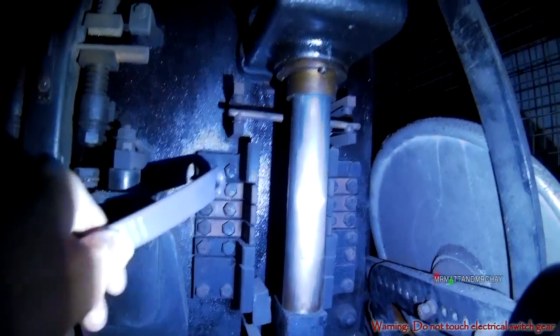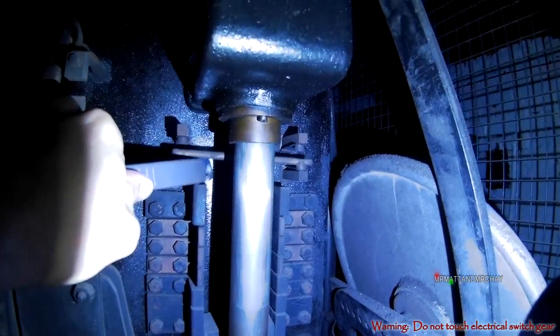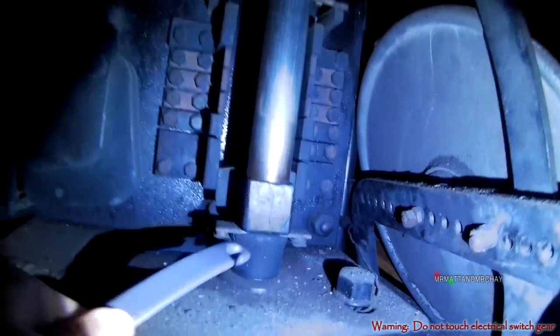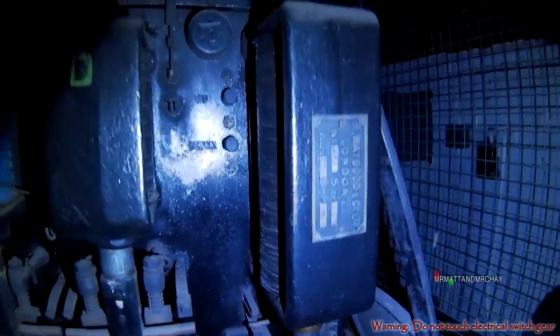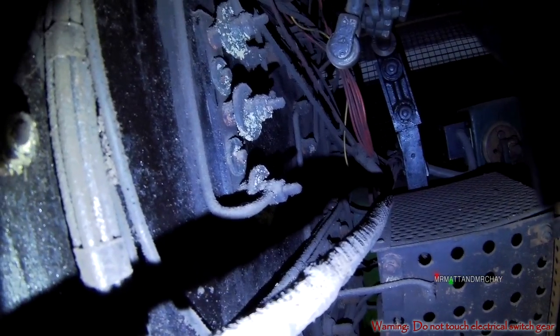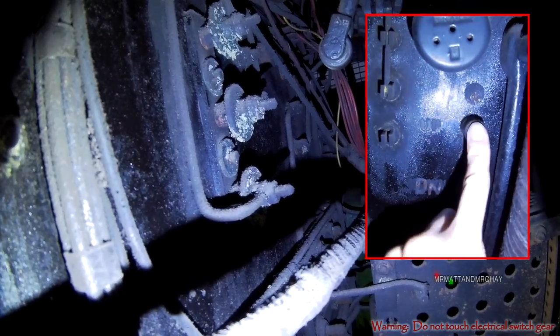It's called an accelerator. It controls the power input to the motor. The moving rod is driven up and down by this giant electromagnet. There is an up and down test switch on the other side of the controller. Standard micro switches did not exist in 1905, so here are the contacts that join together when the buttons are pushed on the other side.